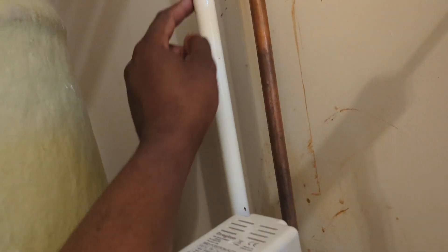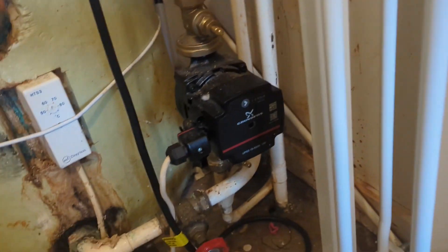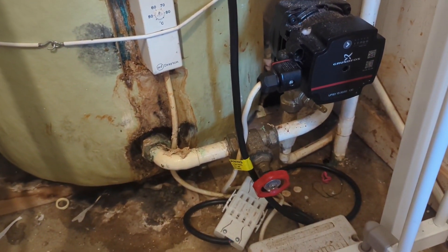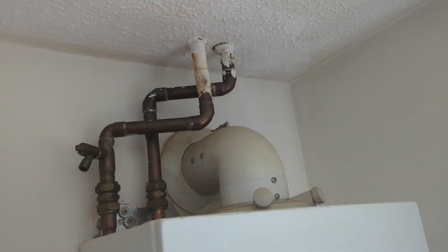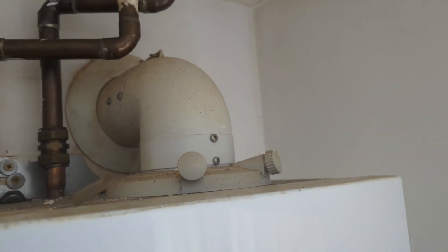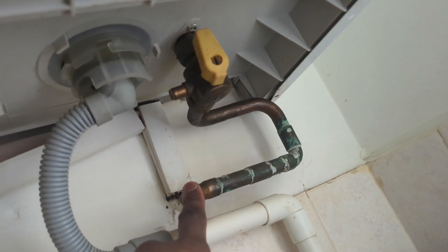Also, in case of over-pressure from the boiler downstairs, it's going to vent via this pipe to the vent section of the small tank in the loft. So we've got those two venting systems as originally explained. In a nutshell, that's what we have with this type of heating system. Looking at the boiler downstairs, you can see the supply and return copper tubes from the heat exchanger cylinder upstairs, and we've also got a PVC pipe for the boiler exhaust.